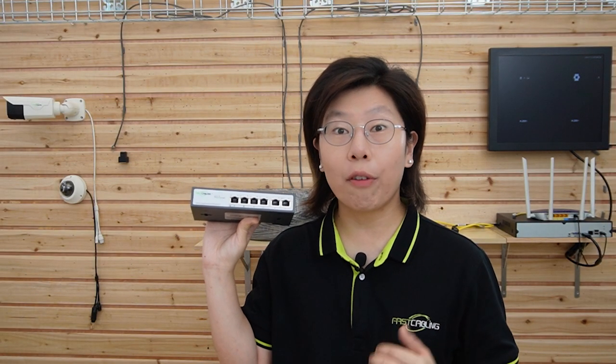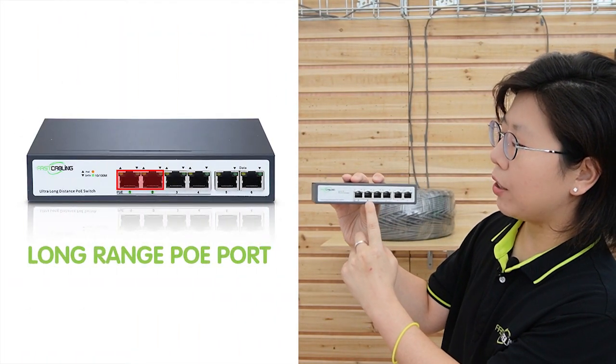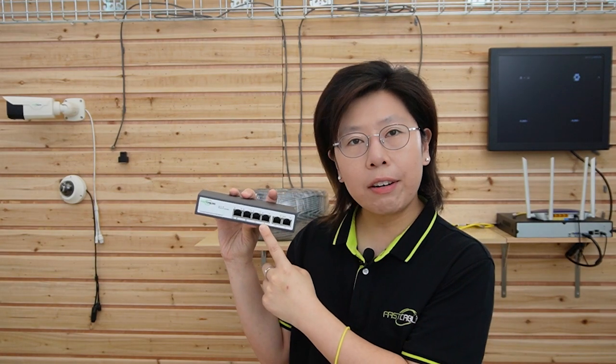It can help you deal with the issue of long-distance Ethernet deployment with an easy plug-and-play feature, so there's no complicated configuration needed. In order to achieve 250 meters — about 800 feet — you need to adjust the port to a 10 Mbps data transfer rate. But no worries, that is more than enough for a full HD 1080p IP camera and a stable video stream. Keep in mind, only port 1 and port 2 can achieve the long-range PoE, while port 3 and port 4 are ordinary PoE ports that support 100-meter PoE connectivity with 100 Mbps data transfer rate.